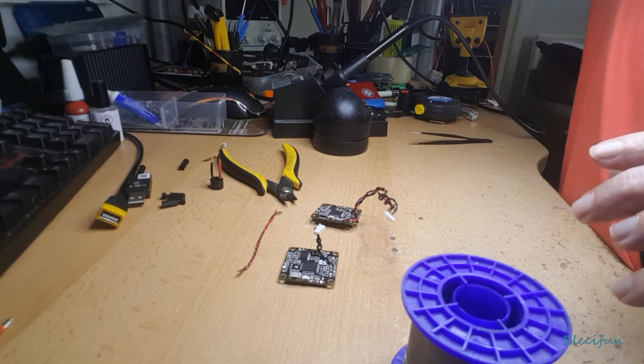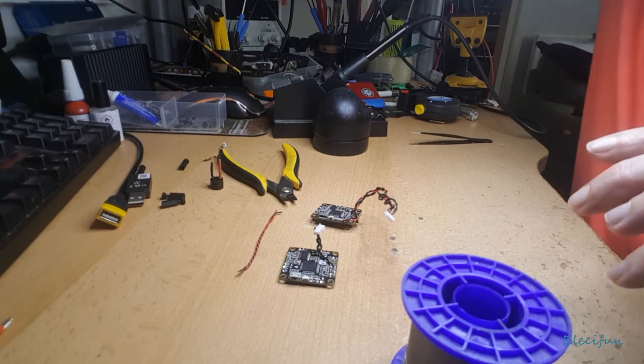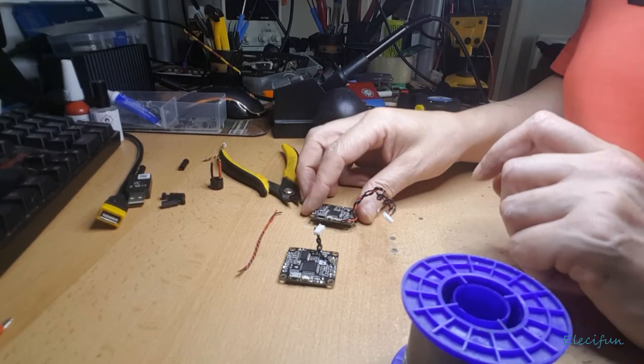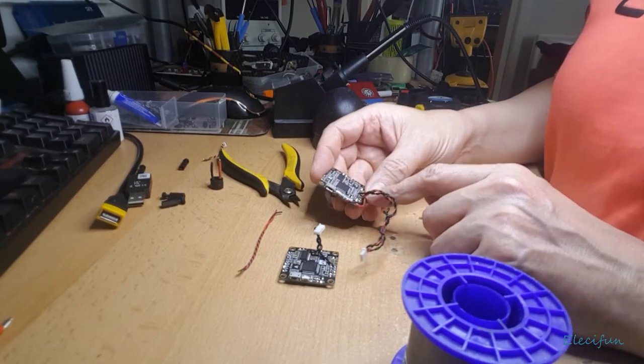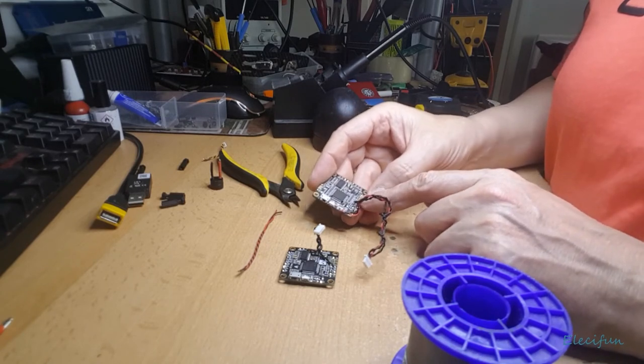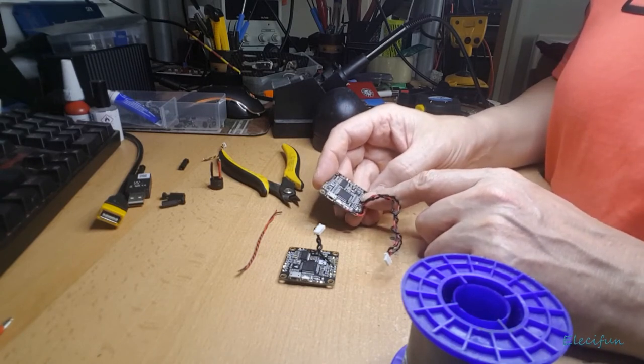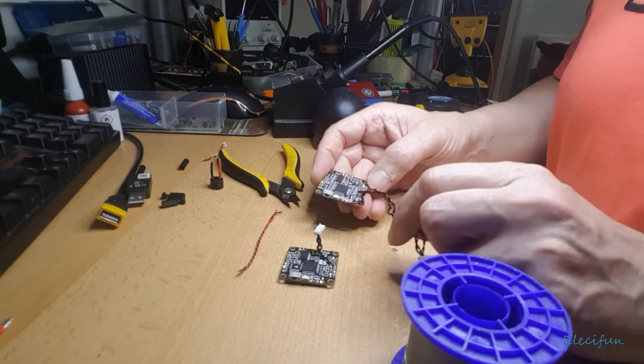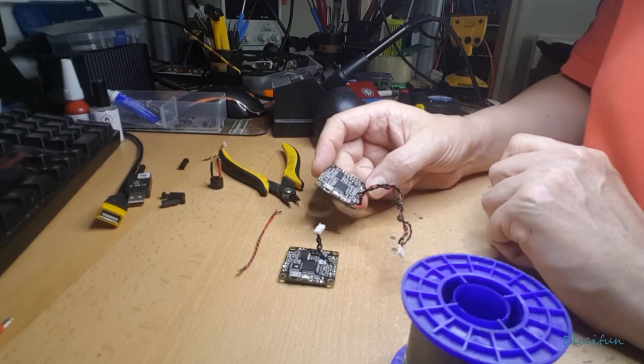Let me just turn this up a little bit. Solder on nice and warm. Because if I did, then I could use the RX2 and the S-Bus for a receiver. And then I'd still have another UART free. It's always nice to have a free UART, something spare. Just in case, I could add Bluetooth.